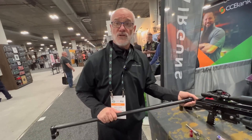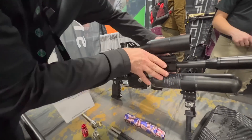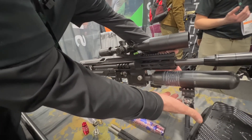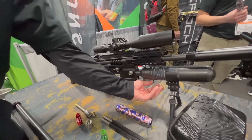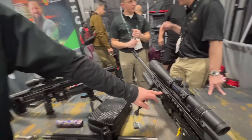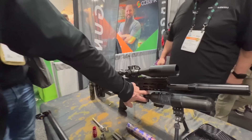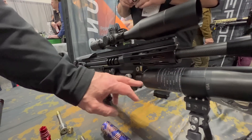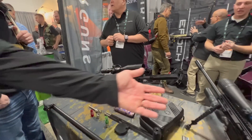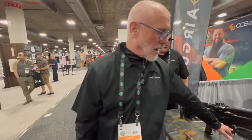Accessories — we're working on our extrusions right now to go around the tank and allow you to put your weaver to mount your bipods, not on the tank, but well under the tank. Obviously you can use the tank, and we also have M-locks in this system where you can mount them on the side of the gun. We'll also put a tank adapter so you can fill the tank separately. We'll probably put a second or third regulator in here — because if I'm benching and only have 1,100 psi needed, I probably want to bring this pressure in around 1,800 to 2,000 psi so that this regulator doesn't work as hard and my standard deviation will get better on my shots.